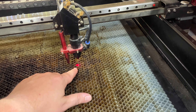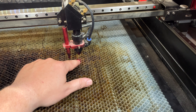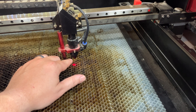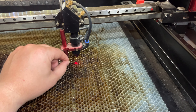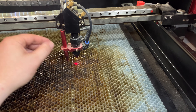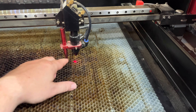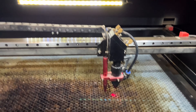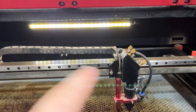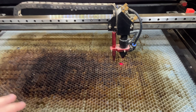One thing I do use is the lasers — that is my starting point. When I pulse it, that's where I'm going to start. It's really important to make sure that's in line so that you're not off by a sixteenth of an inch or more. You've also got an LED strip in the back that gives you some light, which does help.